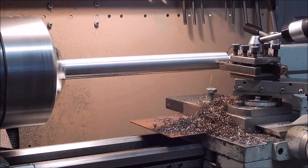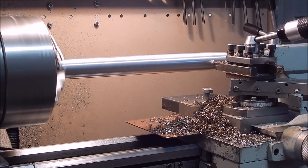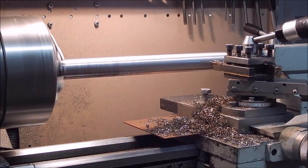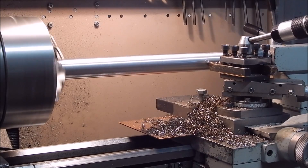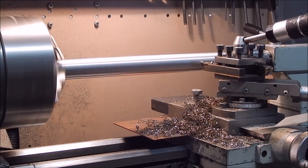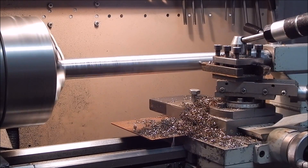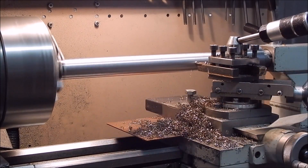This is forged steel. I'm using a carbide CCMT cutter, and after I've done this pass I'll probably come through with a medium pass on it, just to clean it up a bit. Keeps all the rubbish off — does a great job.